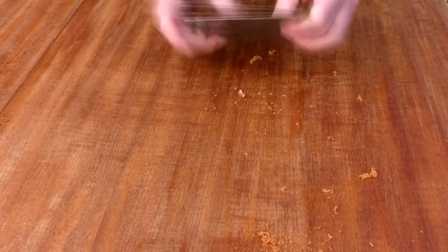I did manage to get rid of the streak marks by scraping, so that was good. It's worth talking about the problems I experienced with the paint and varnish stripper and what I will do differently next time. Firstly, as you've just seen, if you apply this to bare wood it will leave streak marks, so it's always best to apply it with the direction of the grain instead of across the grain.